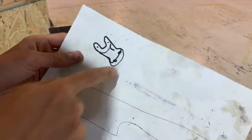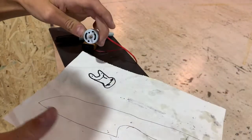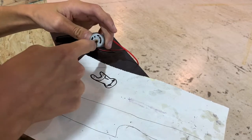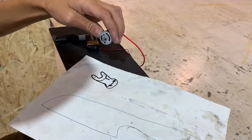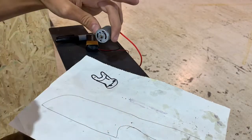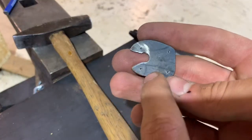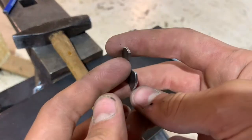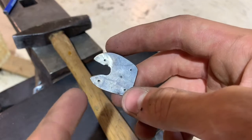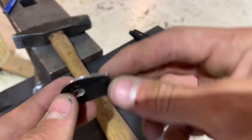Okay, so now I've come up with a motor mounting plate. You'll see what this is — it probably looks kind of weird now — but you see these two holes here: those will go here and then the metal plate will wrap around, and then this will be bolted with these holes to the back of the power hammer. It will be on the side, and then there will be a pulley driving the belt. I'm going to cut that out on the bandsaw now. This is how it will go: the motor comes in here and the spindle comes out. These are the holes that will be drilled, and I have some bolts that will go and screw the plate onto the motor, and then these will screw it onto the back of the power hammer.